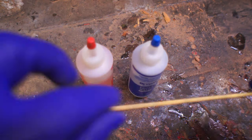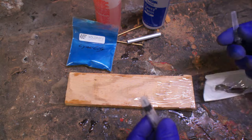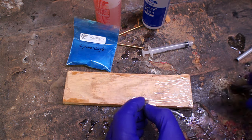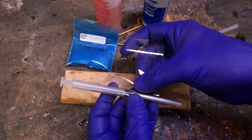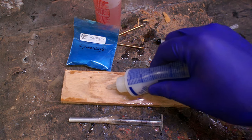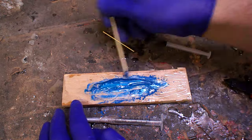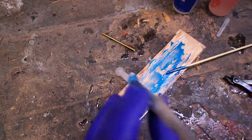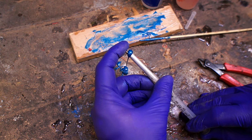If you aren't familiar with what a mosaic pin is, basically you get a hollow tube, fill it with epoxy, and then whatever else you want to put in there. I'm using two pieces of brass rod and I'm going to carry that blue over into the void. I'm using a syringe with the needle cut off so it threads in, then tape around it for a good seal so the epoxy doesn't ooze out. I kept all the epoxy near the top and plunged it to get all the air out first, then stuck those brass rods in and gave it a squeeze until epoxy started coming out the top.